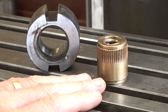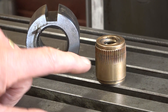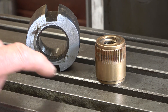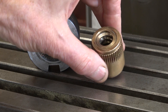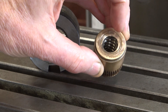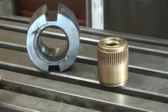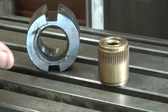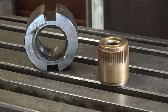It's 32 millimetres across, there are 48 splines, the splines go into this holder. It's a three-quarter lead screw that's 19mm with a 5mm pitch, and this one's quite worn and that's what's giving me my backlash. So using the dividing head I need to cut these splines - it's going to be a bit tricky on this machine, but that's a different story; there'll be a different video.